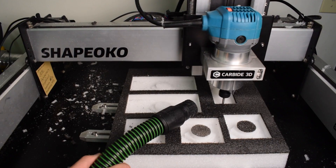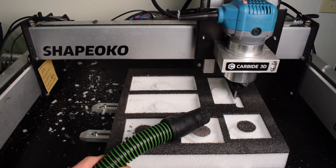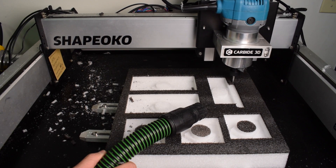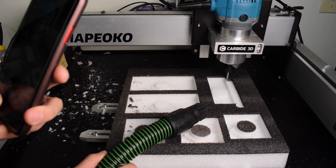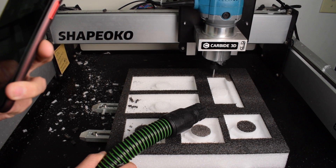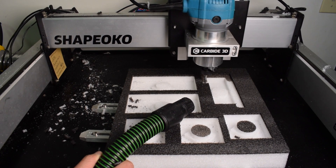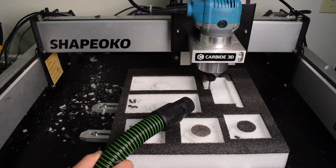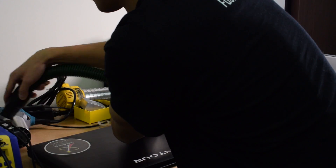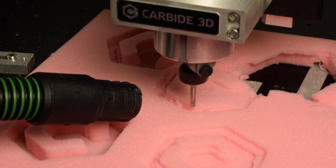So in conclusion I have two takeaways. The first is pretty obvious: yes, the Shapeoko is totally capable of cutting foam, and at a pretty competitive speed too. I'm running 25% faster acceleration than stock at 500 millimeters per second squared and there's definitely room to go faster, but I'm looking to maintain reliability on an open-loop system, not set any records. The second point is that while you can get away with using generic end mills, more specialized cutters will give you better finishes and help you work around material properties of foam at more extreme ends of the density and rigidity spectrum. So if you want to step up your packaging game as a small shop, or kit out your drawers with some Kaizen foam, CNC milling on a desktop machine is a totally viable option - just make sure your dust collection game is on point and be smart about your toolpath application. Thanks for watching, and thank Datron for providing the tooling for this experiment.